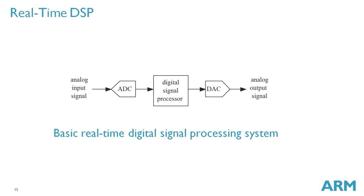What's going to be implemented on a hardware platform is a system like this. We're talking about processing analog audio signals. We need to convert an incoming analog audio signal into digital or discrete-time form using an analog-to-digital converter, and on the output side we use a digital-to-analog converter to convert discrete-time signals back into an analog audio signal. This is the system implemented on the hardware platforms described.